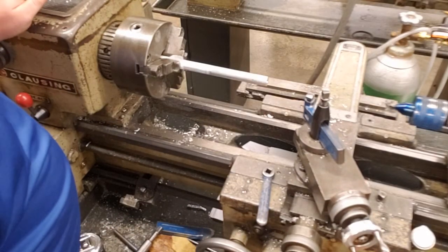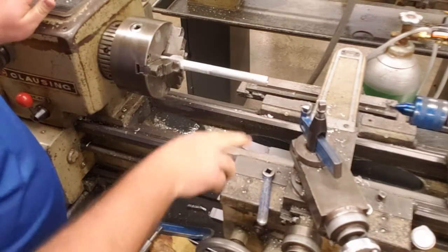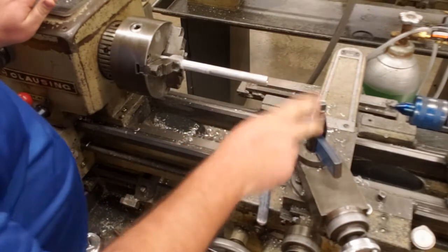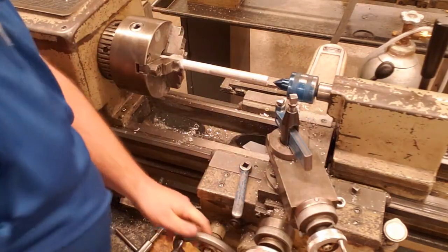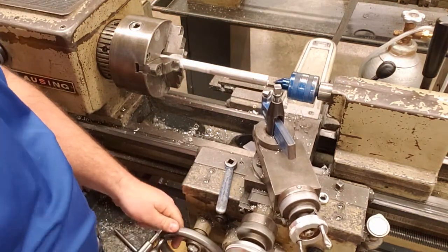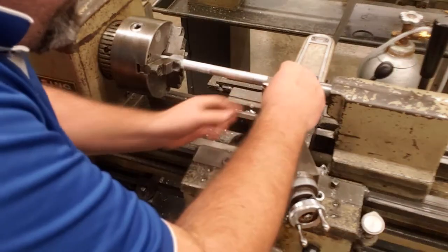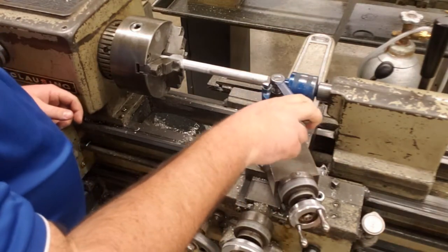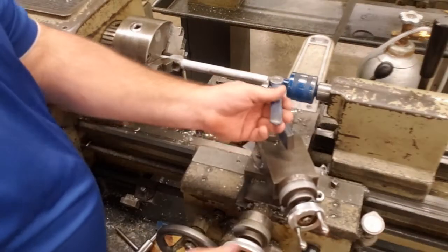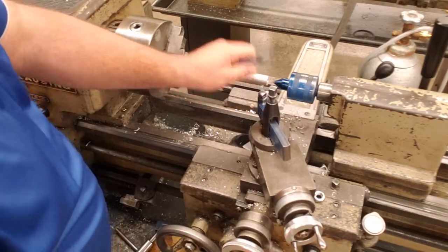We also want to go back to our round nose tool. Our round nose tool is in our offset tool holder. Just like we previously did, we want to bring this a little closer first. We want to touch our tool bit off the work so that our tool bit is centered. So we will get that into position. Once we have it, we'll tighten up our tool post, 2 fingers, light pull. We'll also do the same on the tooling. So, just to double check everything.